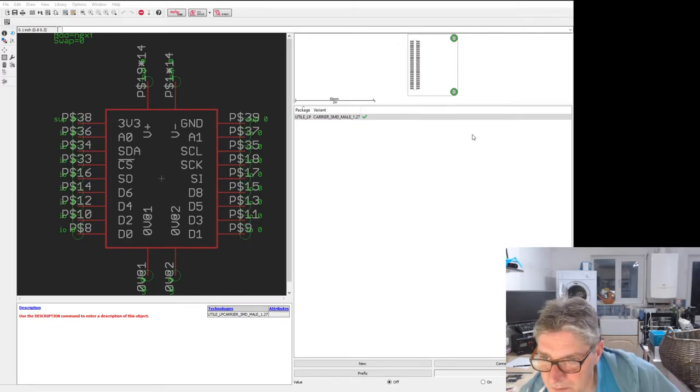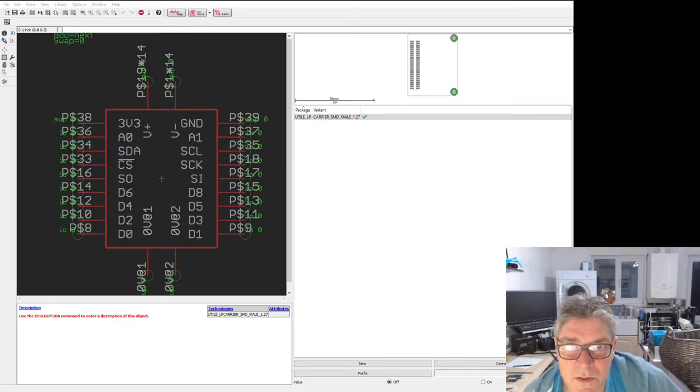So if I look at V plus, so V minus goes P1 all the way through to P7, and then 26, 27, 28, 29, 30, 31, 32. Okay. Let's double check that. 32. 1, 2, 3, 4, 5, 6, 7. Right. And then bottom ones should go from 1, 2, 4, 5, 6, 7, 19 and 14. It's 44. It's the highest one. And that leaves these four pins, which for some reason, there's four pins not connected. That's what I've missed out here.